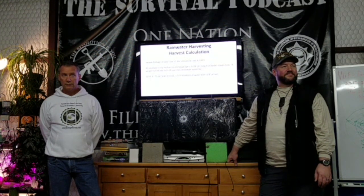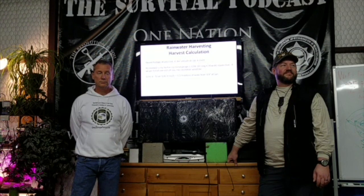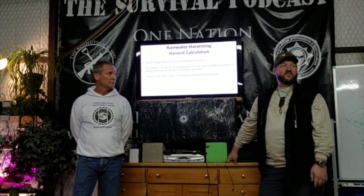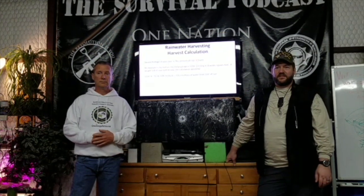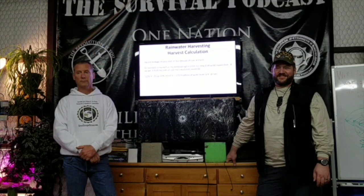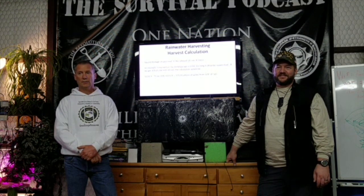Quick, I'll share with you. There's an online spreadsheet where you can put in monthly use and your average rain in inches per month, and it'll tell you how many gallons of storage you need to make sure you never hit zero. That's what I was looking for, actually, because it has the first flush calculations in it. Yeah, if you're in Texas, go to Texas A&M. They'll do all the calcs. They'll tell you how much rain you're going to average over any given time. They've done some really good work.